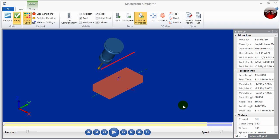It took a while but it finally finished. I had to go back and change the step over to 0.05 again — doing 0.01 took a lot of resources and my computer couldn't handle it. So both the roughing and finishing surface finish will use the same step over. In a real exercise I would recommend minimizing the step over — at least make it half, or even one fifth smaller.